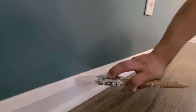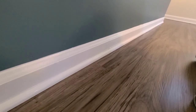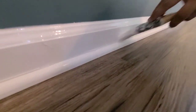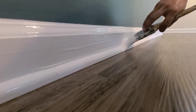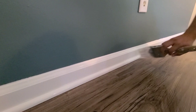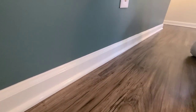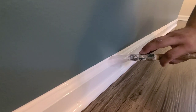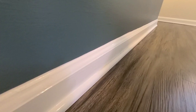Get some paint on there, come to the top, make your line. Get a little bit more paint, lay it out horizontally, get the excess off, make your line, move your arm about a foot out, then come back and lay it out. This paint hangs really well so you can get a heavy coat on there. Get your excess off, make a straight line, move your arm — not your hand.